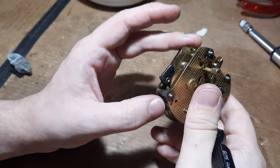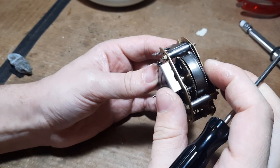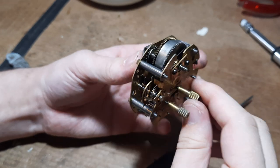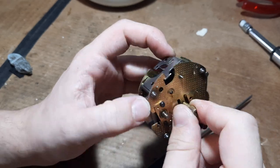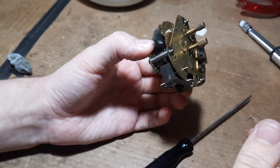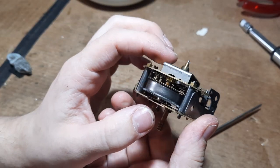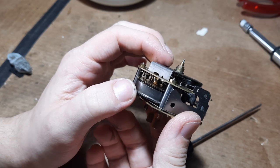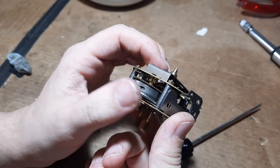I will do that soon, but I'll also just inspect the movement to see anything else that may pose a hazard or will make disassembling not as easy as it could be. With these ones, I don't think there is a way to let the power down out of the spring, so I'll put the alarm on and let it ring - that'll help get some of the power out of the spring. But there is a mechanism on here which stops the alarm unwinding too far, and therefore we won't fully unwind the spring. So I'll be very careful.